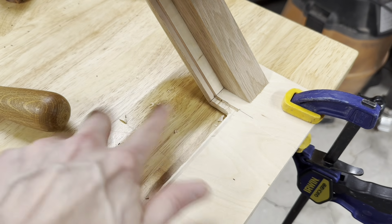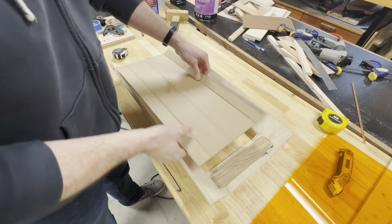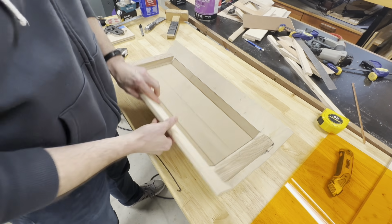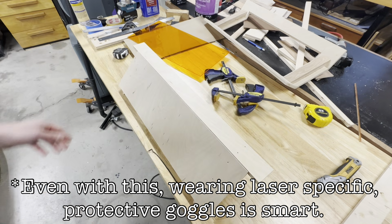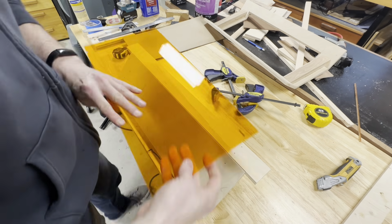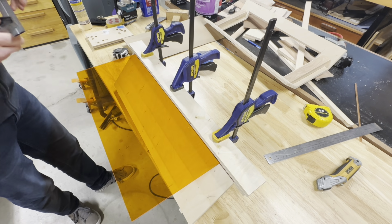So you can hurt your eyes with the glare from a diode laser, and what I have to help filter that is this piece of orange welding plexiglass that is used for welding enclosures. I have it left over from when I built mine a few years ago. Of course, for coolness factor, I had to bend it to fit into my lid.